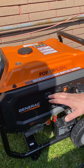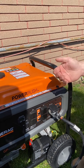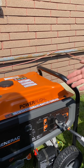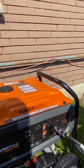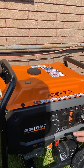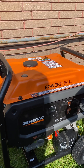Just because the motor is on doesn't necessarily mean electricity is flowing — there's a breaker switch that controls the electricity, and that one's off. When you hook up your cords, always hook the cords up before you start anything — you want no electricity in the cords when you're plugging in. Your cords are plugged in and the breaker is off, which limits electricity while you're starting the motor. You don't have to pull-start this — you simply put the switch up here and crank it over like starting your car; you don't hold it, just crank until it starts.